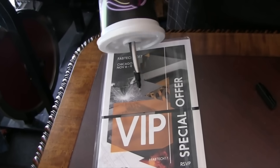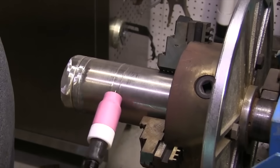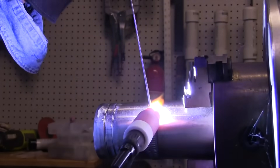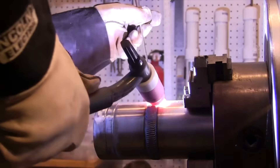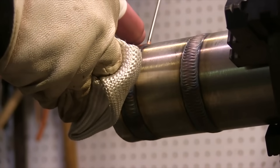Some test shops want you to be able to walk the cup. Walking the cup is akin to rolling a 55-gallon drum across a shop floor — you roll it back and forth in a figure-eight motion. It's all about light pressure, having the right extension on your electrode, choosing the right cup size, and then just building those motor skills until it feels comfortable. In this case I was welding on some really heavy-wall stainless tubing. Some jobs won't want you to walk the cup in the test shop — it depends. But if you can't walk the cup, you need to learn how to freehand. This thing gets rather warm, so you saw me prop on the very end with the TIG finger so I can focus on welding instead of how hot my finger is.